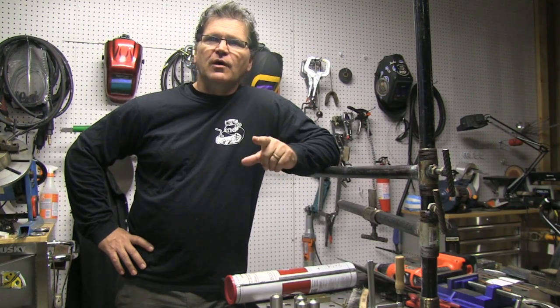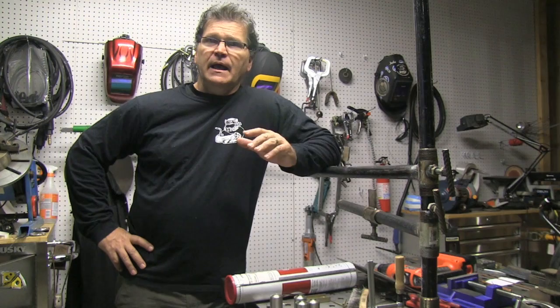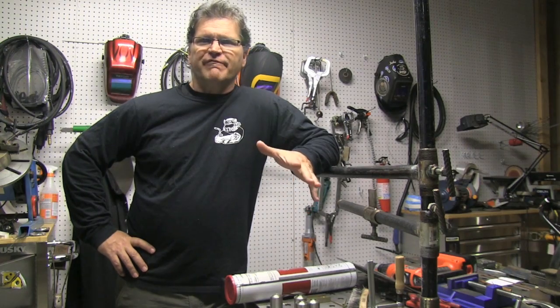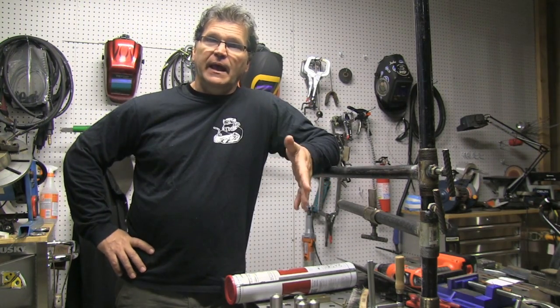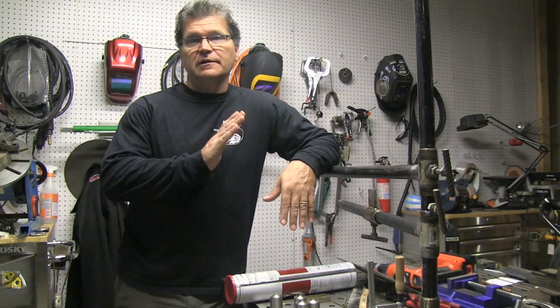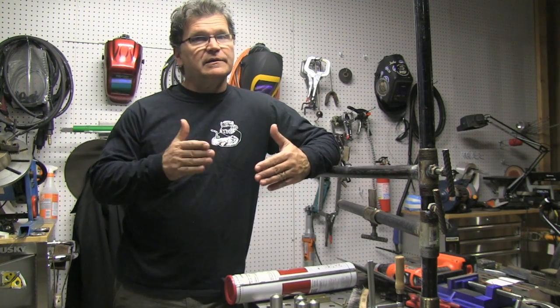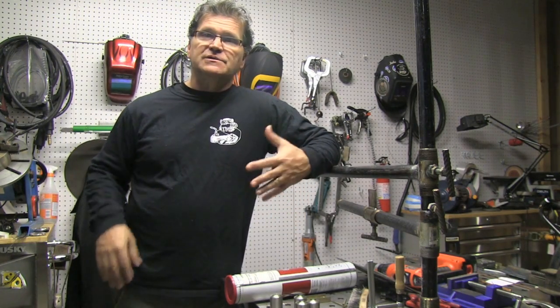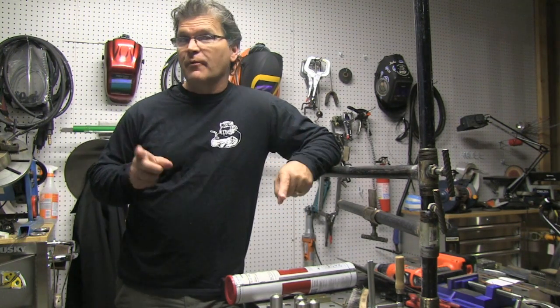We're talking about vertical uphill MIG welding today, and the reason that comes up is because I did a little quick repair for somebody on a forklift a few days ago. There was vertical uphill MIG welding, and also we knocked a little chamfer on it. It was a fillet weld, but we knocked a little chamfer on there to get a little bit more throat size on the weld. So that gives us something to talk about today. So that's what we're going to do.